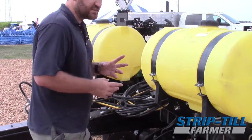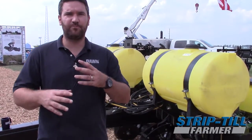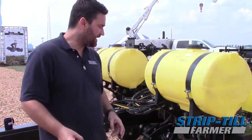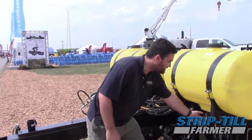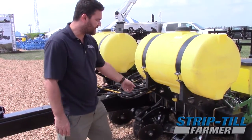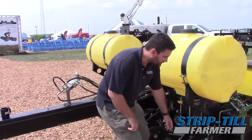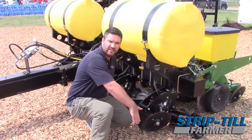Normally when people think about a crimping roller, they've traditionally thought about a big, large diameter, heavy roller in one piece on the front of the tractor. This is totally different. Every row unit has a parallel linkage that can float up and down, and you set the down pressure hydraulically to say, I'm pushing on the ground this hard. Then the plant material comes at it, and these discs right here are not really to do any soil disturbance. What they're doing is channeling the flow.